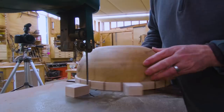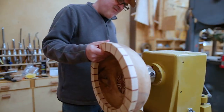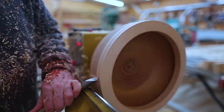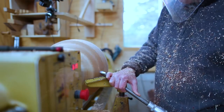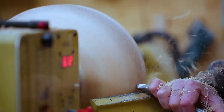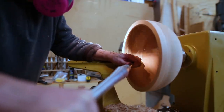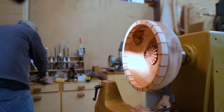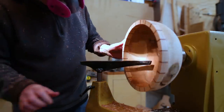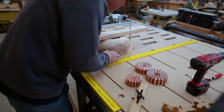I don't need the tabs anymore. I could turn them off on the lathe but figured it was a little easier and safer to do it on the bandsaw. I can do a pre-turning — get the bowl round and get the rim skinnied up a little bit. This sets up the bowl walls to be thinner when I cut the holes for the inserts, so I won't have as much material to remove. I'm not trying to get a good surface at this point, just getting everything round and the walls thinner. I can work on the inside — mostly the rim and a little on the inside to get it round — and get to the bottom of the bowl.